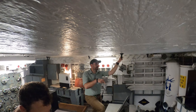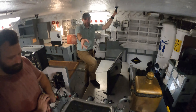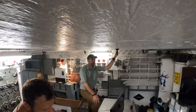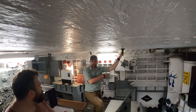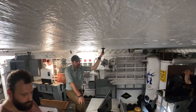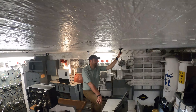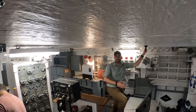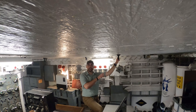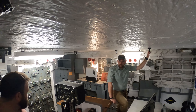You can fire these guns locally using the periscope, like they sort of show in the movie. This is a Mark III Rangekeeper, so you could plot your own fire control solutions here without having to go through the whole fire control computer down below. From here they control the elevation of the gun barrels and train the turrets — or the guns can be slaved to the rangefinders, and when they point at a target the guns automatically come around with it.